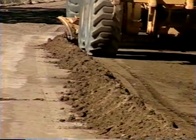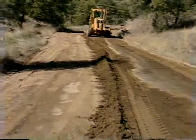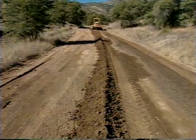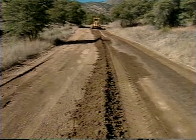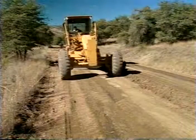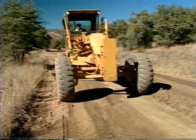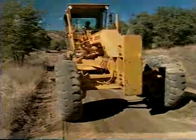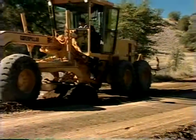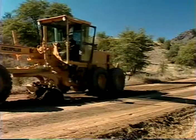During your second pass, you'll normally repeat the process outlined in the first pass, except that you drive on the other side of the road. Again, move the windrow material to the road's centerline. Subsequent passes should spread the surface materials from the windrow back over the traveled way. Adjust the mold board angle to spread half of the surfacing material in one length, leaving the remainder for the opposite length.